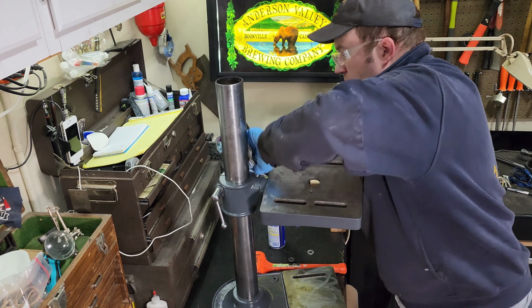Here on the front, this is where the, I guess, the depth gauge would go. You take that off when you have these tapping heads on here. This tapping head is designed for the DP220, and that handle right there is what you're using to keep that torque from pulling against the quill. So you need to hold that handle while you're pushing the tap down, so you're not letting all that torque rest against the quill.